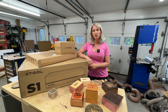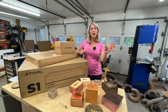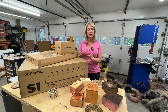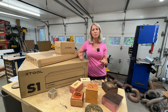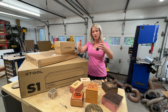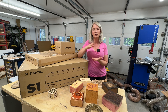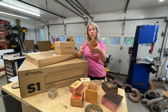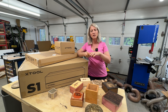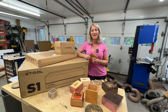Another really cool feature I've never seen on any other laser is the ability to engrave on a curved surface. You take the laser module and place it on the top-left corner of your material, then move it to the bottom-right corner. You tell the machine to create a depth map — it moves the laser in small increments left, right, up, and down across that surface, measuring the distance between the material and the laser head. It creates a depth map so it knows exactly the distance and can engrave on curved surfaces like wooden spoons and plates.